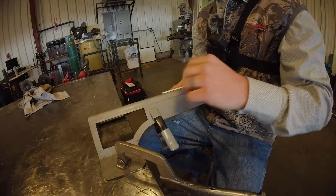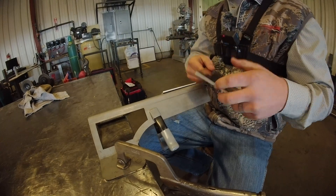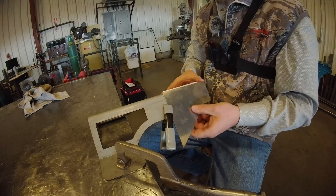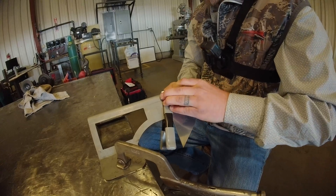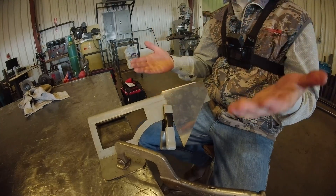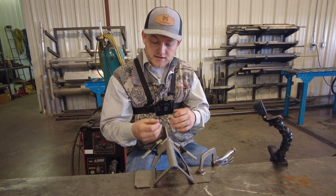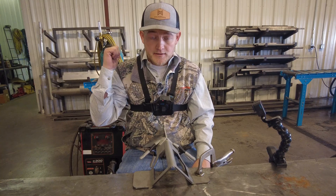So this is how it works. I'm going to take one piece and just put the clamp on it. Grab the other side — these are just two random parts I grabbed off the pallet over there. Now that I've got these clamps on, I can manipulate these parts to get a perfect weld joint and then be able to tack them hands-free. That's the important part. Let's work on learning how to tack, let's work on learning how to fit — let's not hit them with everything at once. Once they get frustrated, learning goes out the door, I promise.